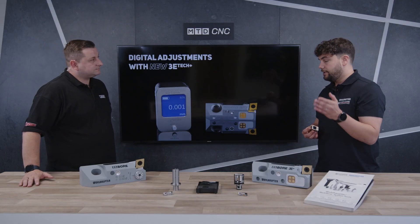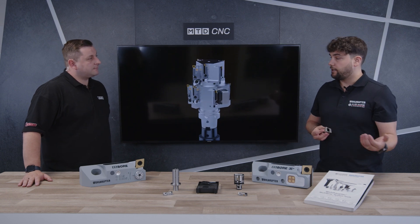That's a lot on the digital display and its accuracy, but what if I don't need accuracy down to a micron — do you have something else I could use? Sure — we have the cartridges in a digital version and also an analog one. With the digital display you can adjust to one micron on diameter, but on the analog one, if you don't have such tight tolerances, you can still adjust it to five microns on diameter.